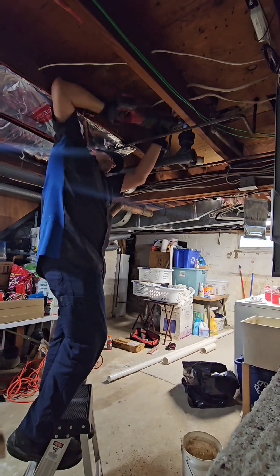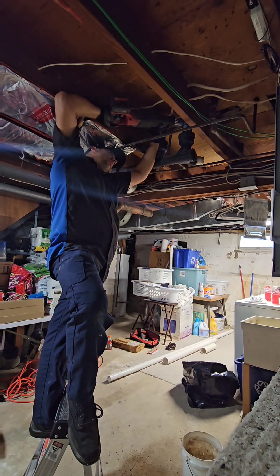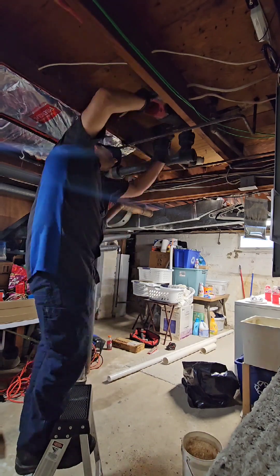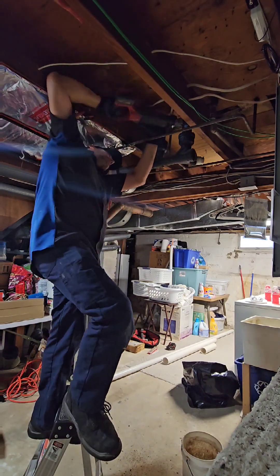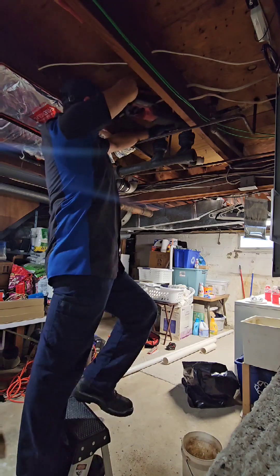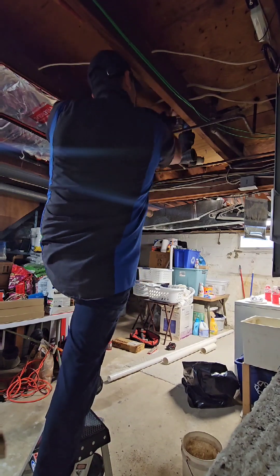I'm gonna try one of my little tricks when I have everything apart: I use a one-and-three-quarter hole saw and just clear out the hole inside of the two-inch cast iron — comes out squeaky clean. So I'm right here cutting it out, almost all done, just checking around since I have no clearance at all.